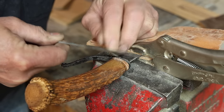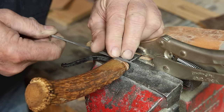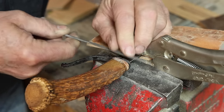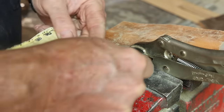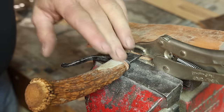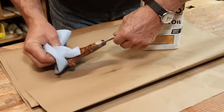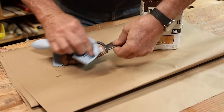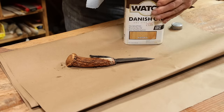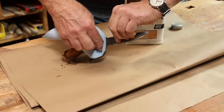Just a little bit of clean up — it's not quite perfectly flush, it's hard to get everything lined up when you're trying to clamp it end to end like that. But it took very little work to get it the way I wanted to; just a little bit of light sanding and I think it looks a little better that way. I'm just using a Watco Danish oil on this to put a finish on the antler. Mineral oil would work, and I suppose boiled linseed oil would probably work too, although I don't think I've ever used that on antler.